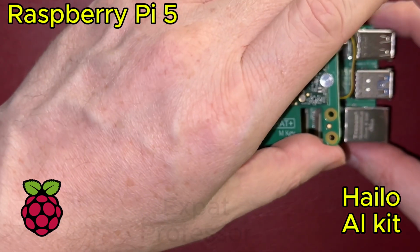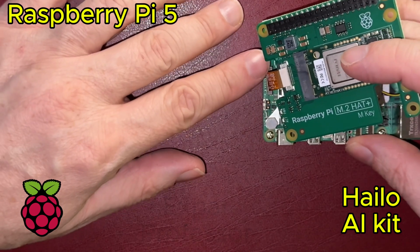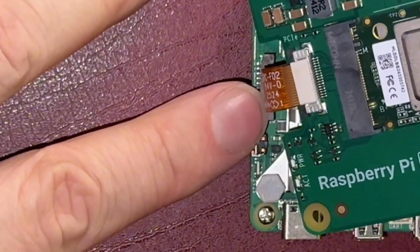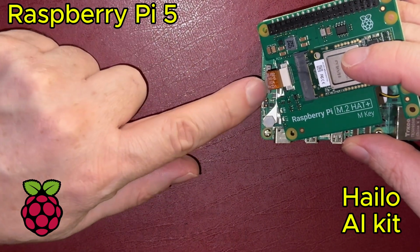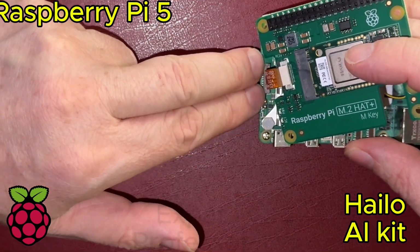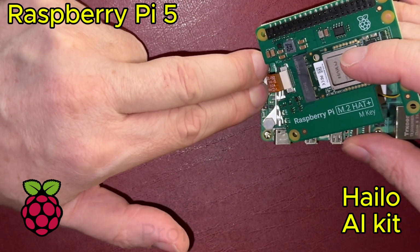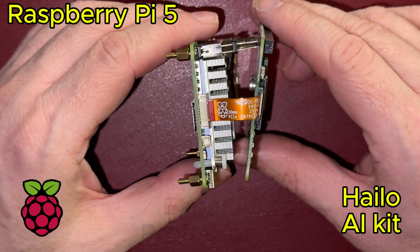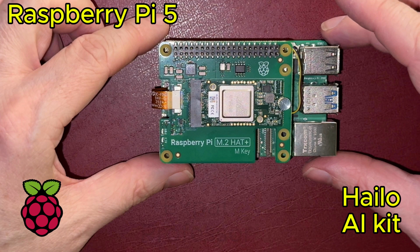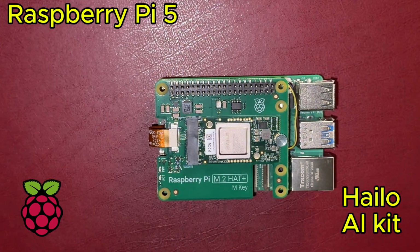Eventually, the idea is to close these two boards on each other. But before we do that, we need to press gently with fingernail on top of that little brown piece that we just pried out. And we need to do it at both ends. Now that the cable sits firmly in its place, we can take care of the headers. That was the most difficult part to accomplish. Eventually, after bending and straightening up a few pins, it's all done.